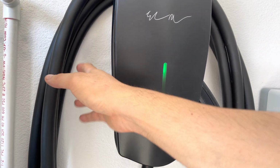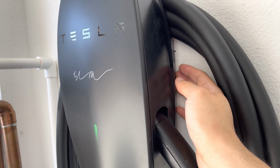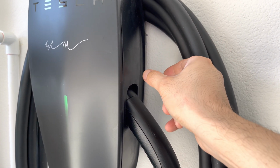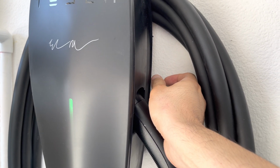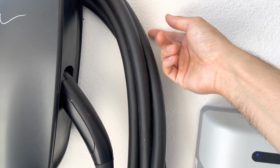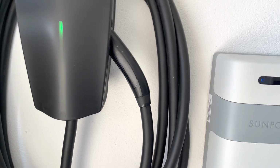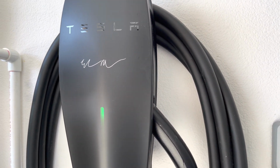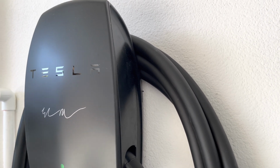The installation, so you can see, it's right on the wall here, the drywall. I would recommend installing maybe a plywood behind it, so when you're putting the wires up, you're not scuffing up the orange peel here if you have texture drywall, in this case.